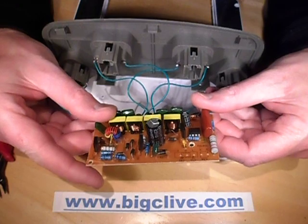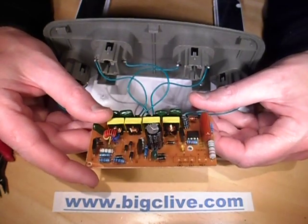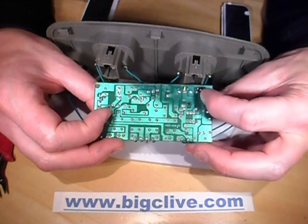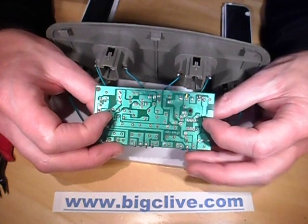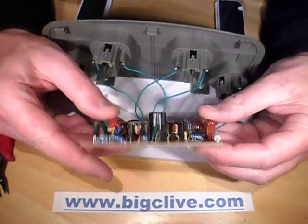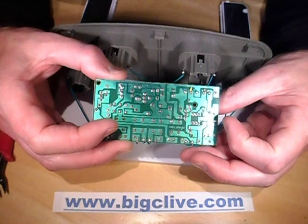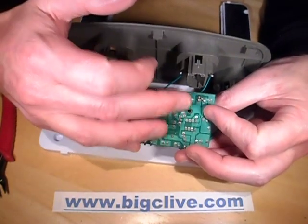That's feeding a chip which, rather suspiciously, is looking like a PIC-style microcontroller with just four of its eight pins connected — the power pins are connected. From the positive power pin it goes through the button to an input, which is probably just being pulled low internally and then pulled high when you push the button. The other output goes through a 1K resistor to what appears to be a sensitive triac. And then it switches on the ballast, which is bypassed completely when you put the switch into the manual position.